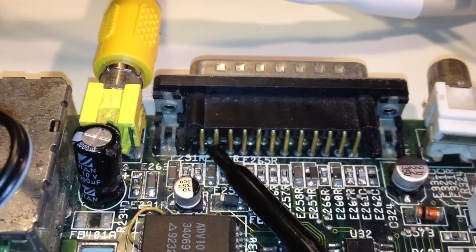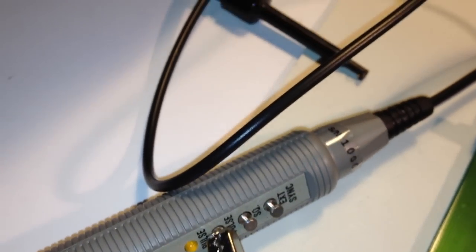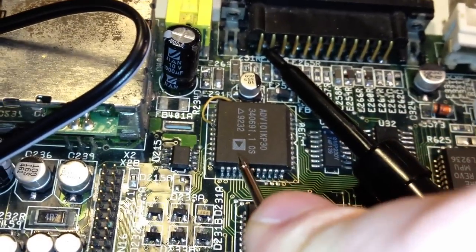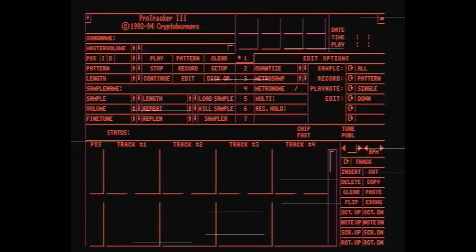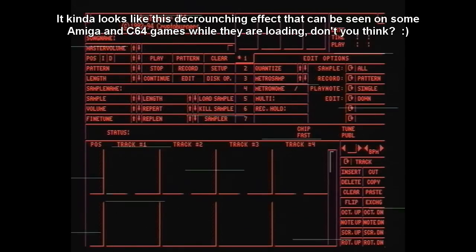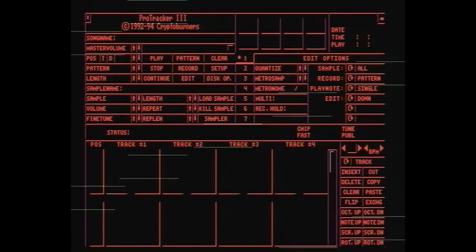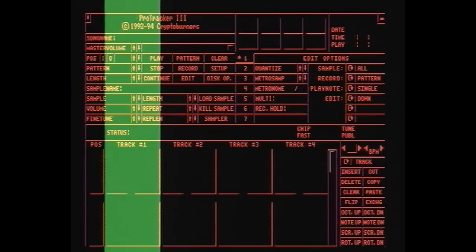I thought I would just show you quickly here what happens if I disconnect the horizontal sync signal going into the logic pulser. So here I have it disconnected, as you can see, and I will now again take my probe and inject pulses into pin green 7 of the video DAC. So here we go. And now we just have this flickering going on there on the screen. And now I will again reconnect the horizontal sync signal to the external sync input of the logic pulser. And there we go. Okay, and now we have this vertical bar going again across the screen there.